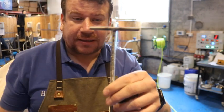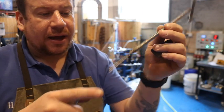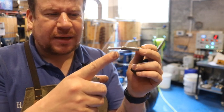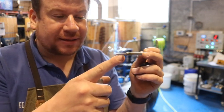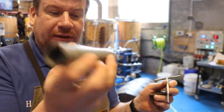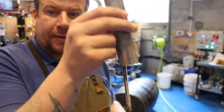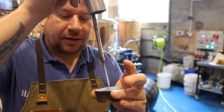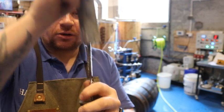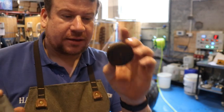It's just a piece of threaded bar and I've welded it into a T-shape on one end. And on this end I've got a 60 by 4.5mm stainless steel wood screw. And then I've just got a little bit of 40mm scaffolding pipe to make a puller. I just screwed that into the top of the bung and a couple of short, sharp wacks — and indeed the bung came out.